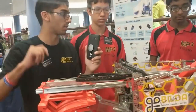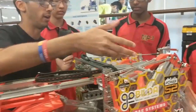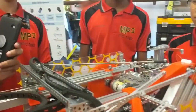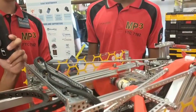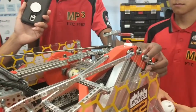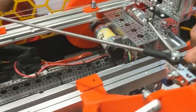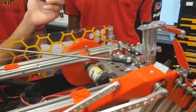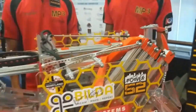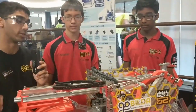That's been really successful in your matches. Can you tell me about these screws? We don't see linkages like this very often. At the beginning of the season, these slides would shake a lot, so we needed to find a place to mount them. We had this piece already mounted to these Misumi slides, so we added these pieces — they're great because you can mount them at different angles. We mounted them to this channel and to our hang, which are stationary, so the slides stopped wobbling as much.